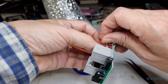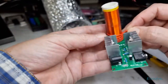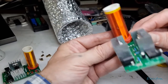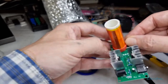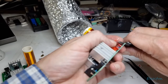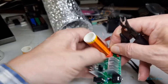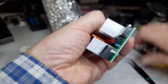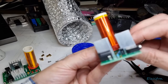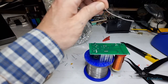All we've got to do now is get this off without yanking the whole thing off — very carefully. Just bend that around and push it through. I could probably turn that down a bit neater so it goes more directly into the hole. Be careful when you cut this because if you cut too far you'll make it too short and you won't be able to get those extra turns on. I was mainly trying not to pull the coil off. We can get to play around with it and see what the difference is on power output.